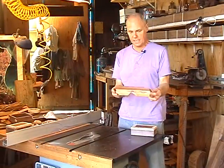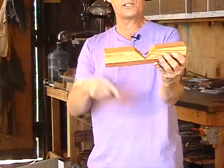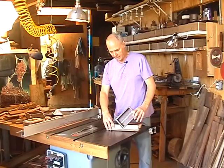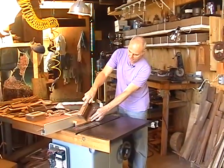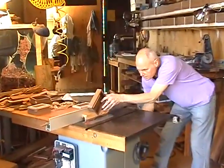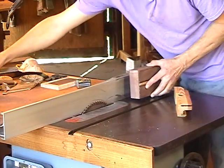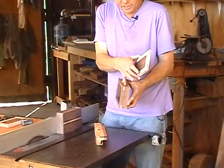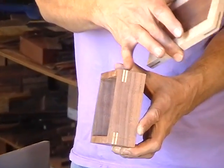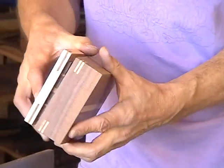The tool is just a piece of 2x4 — I cranked my blade to 45 degrees, ran it across, and made a trench which is basically a right angle turned on its side. The box and lid will run through this jig right up against the fence. We set the blade at just the right height to cut in but not through. As a design feature, you can position splines close or far apart, put in two, three, or four, vary their thickness to make a pattern — it can be both a design and a construction feature.